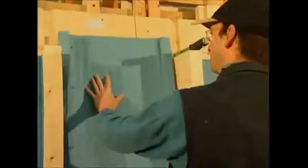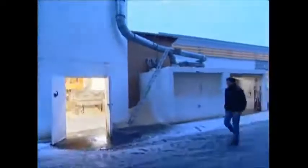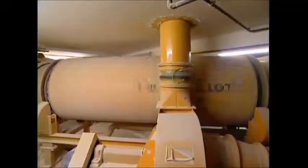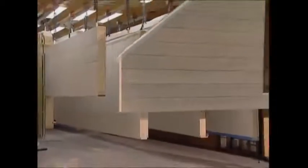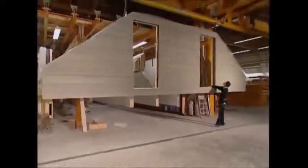Cork-studded cardboard is fixed to the inside of the wall to help prevent drafts, but all of the walls have to be fully insulated too. They use wood shavings gathered from factory waste, but first the shavings have to be pre-treated. They are tossed about in soda and a milk serum. The soda protects them from the fungus that can cause rotting, and the milk serum makes them fire resistant.